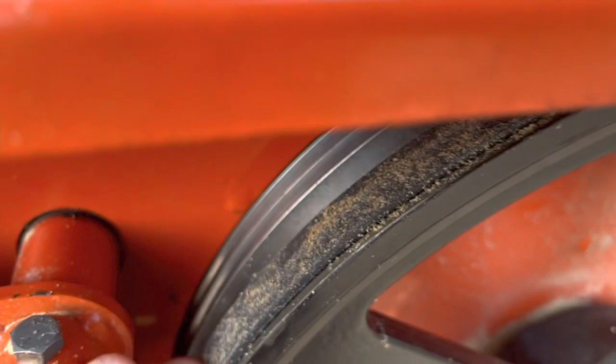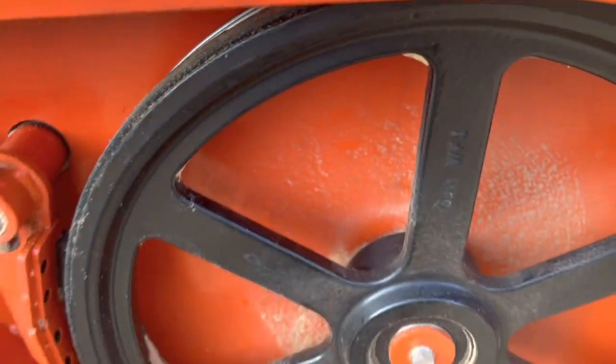If you notice under these belts, how clean they are. See up underneath there? There's nothing in there. Little bitty minor stuff. There's no buildup. That diesel seems to keep everything clean, especially with that pine rosin. That pine rosin is bad about building up on these. On the rollers the other day, which right here on this roller,